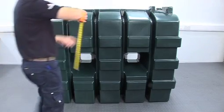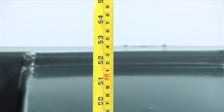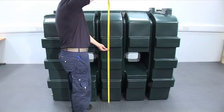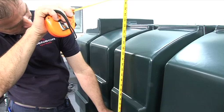At this point, the height of the tank can be measured using a measuring tape as shown. The measuring points are from the base of the tank to where the transmitter will be placed. Please take a note of the height. Make sure to measure the tank only, not the platform or base it sits on. If you are measuring the height of a bunded, double skinned tank, it is the height of the inner tank that applies.